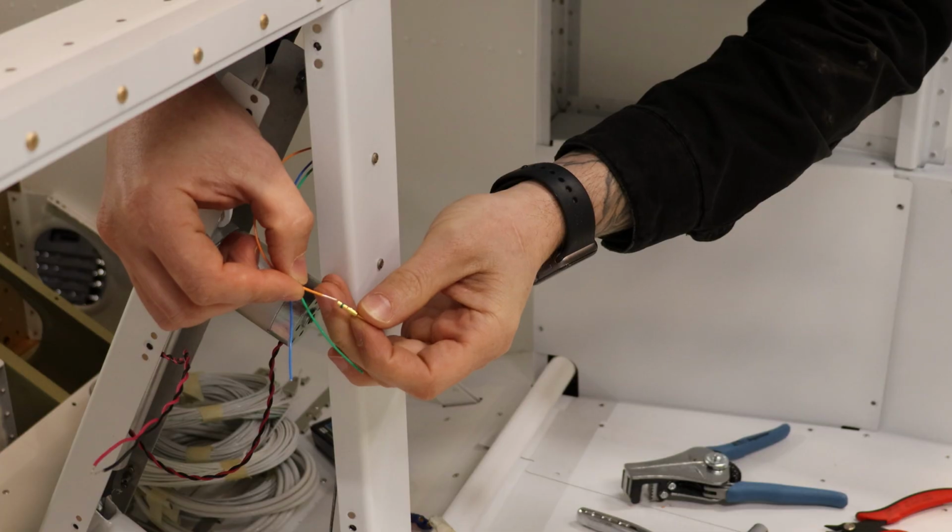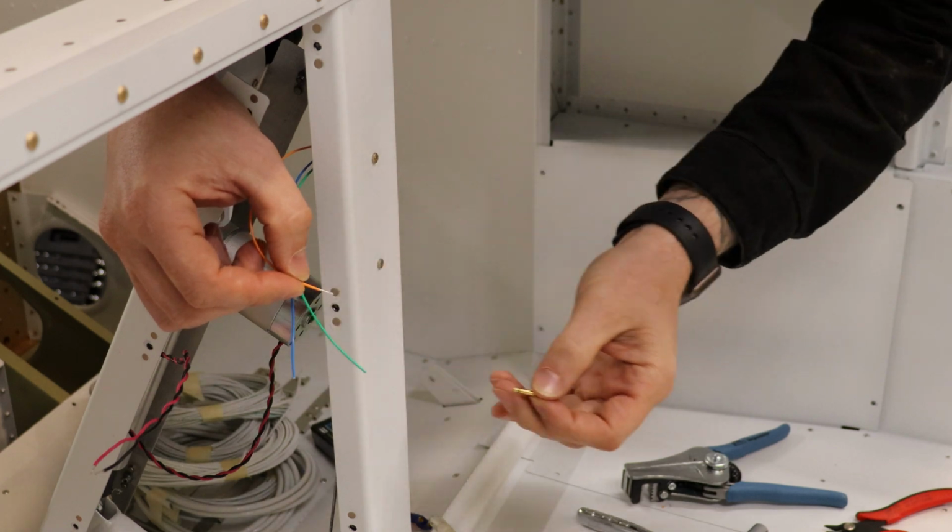Luckily, when it comes to the Garmin stuff, I have tables that translate pretty well. When it comes to these particular connectors, I'm a little lost, and so I do know that I've got this set to allow us to position it correctly. Perfect. Got to make sure it's the right positioner, and we have to make sure that our setting on the crimper is set for the gauge of wire that we're using. Once all that is set, we'll simply crimp.